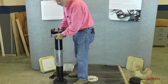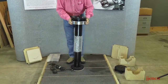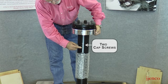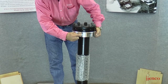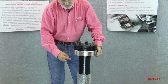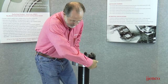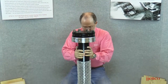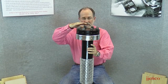Now we're going to take this unit and lift it up and move it right over here onto the mounting platform. You'll notice in front that there are two cap screws down here. These cap screws serve a mounting purpose inside the unit, but they also always align with the number one position stamped in the side of the shroud protection plate. Each bolt position is stamped around this plate — it's useful for an instructor to know where that number one position is so you don't have to hunt for it when you're teaching. I like to turn this around so that the number one position is facing away from the class, which allows me to always know that the number one position is back here next to me.